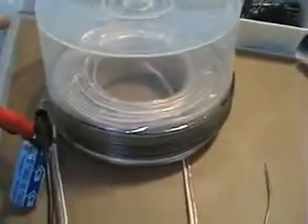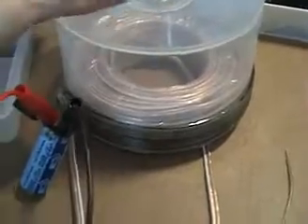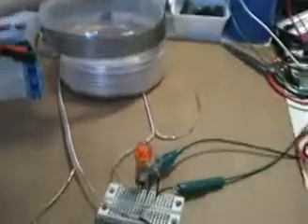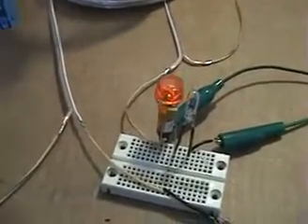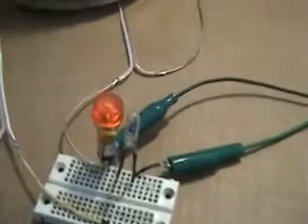We take the pickup coil and it happens to fit perfectly over the resonating coil — though a tight fit isn't necessary; the pickup coil can be about an inch away. You need to play around and test with it. You can see the neon bulb is lighting because the coil is at resonance. When I move the pickup coil close, the bulb extinguishes — the radiating energy is now being picked up by this antenna coil, putting the circuit out of resonance.